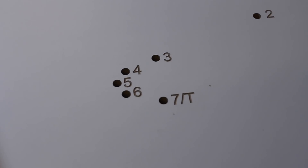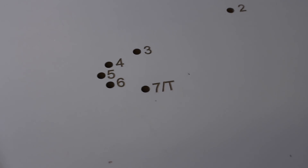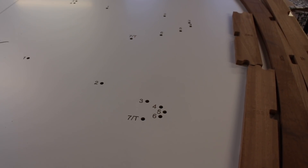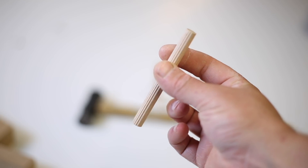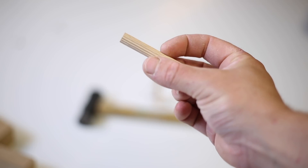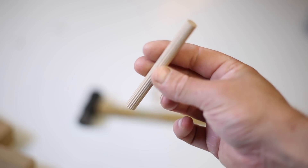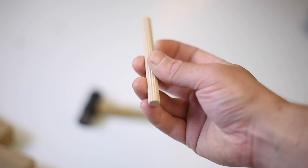The frame construction board has holes for each frame and those are engraved next to each hole. The first thing to do is find all the numbers for that frame and knock an alignment dowel into that. I'm using a 10mm fluted dowel - the little flutes help it sit quite nicely and tight in the hole without any air locks. I definitely recommend them if you can get hold of them, though a standard dowel will work fine too.